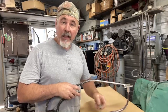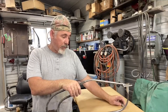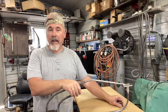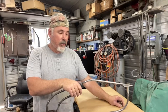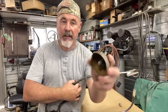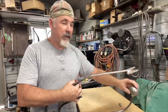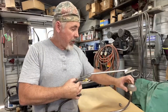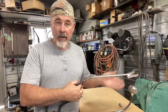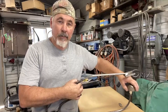Some guy left a comment saying that they made their own bullseye pick and they have different tips. I thought that's probably a good idea, so I made different tips. This one right here, you see, it's a dome. It would be good for rounded bodies — you just screw it on and that would help on the fender where it's got a nice radius, so this wouldn't have any flat spots when you pull the dent out.